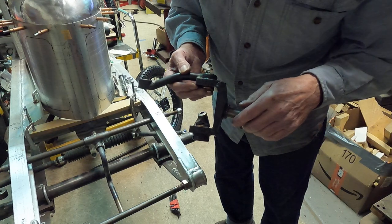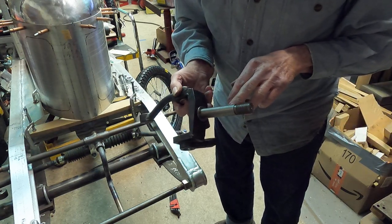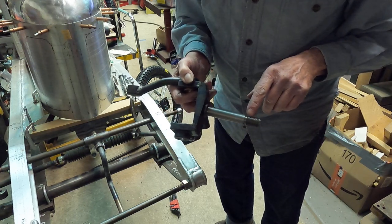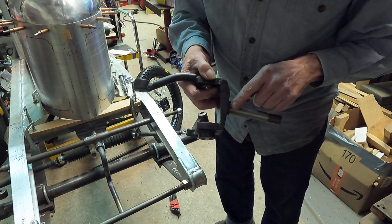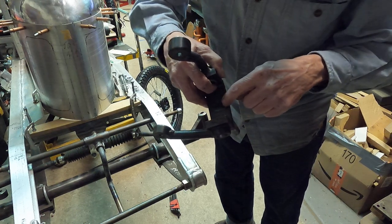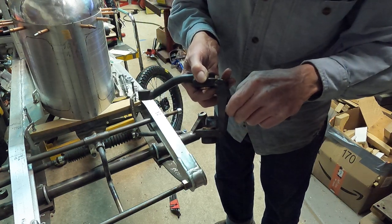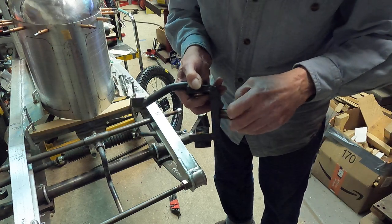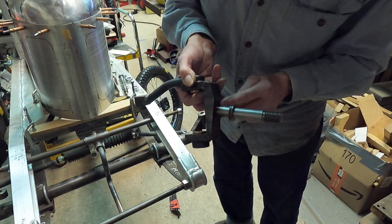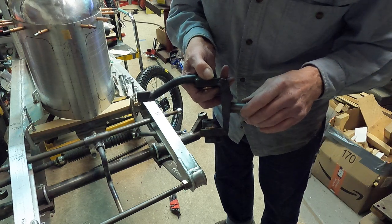The sub-axle is just three-quarter inch cold rolled steel. I single-point thread the outside. There's a reamed hole in the upright — this goes through the reamed hole as a nice tight fit, and then it's welded on the back side with a stub weld in there. I do that because I don't want any stress riser at this point. If I threaded it in or welded it around there, that area could crack on you. This works out pretty well — it supports it nicely and I've never had a problem with it.